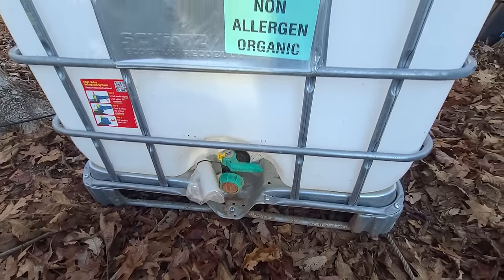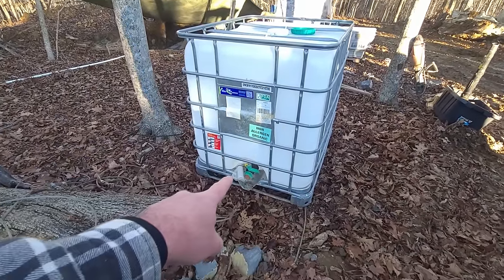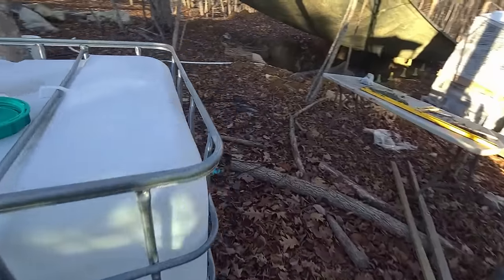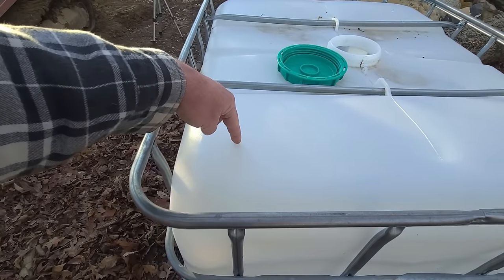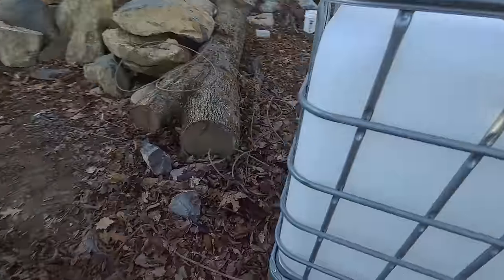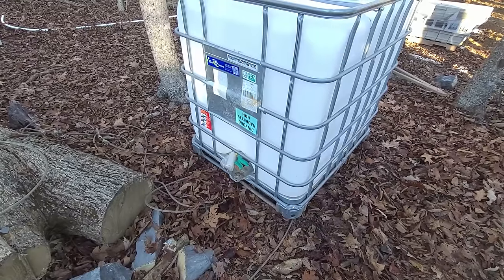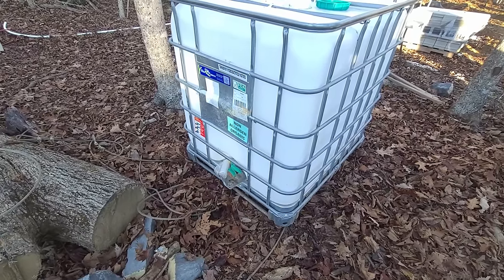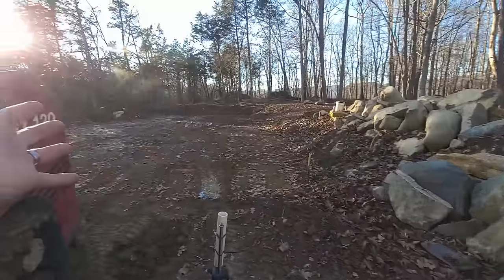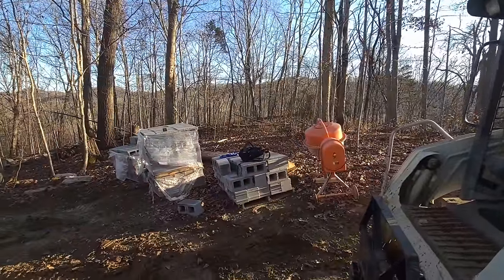Last episode I was talking about our water containers. This is them. There's two of them. We're going to series the two together, probably with some PVC, and retrofit. The PEX line will come into the top of one of them. When you series them together, they will equalize, and then the output on one of these spouts will be connected to an exterior shallow well pump, which will pressurize a pressure tank in the root cellar. That will be our water solution for our house, and there's going to be a wood boiler right around there. So it'll serve all of that.